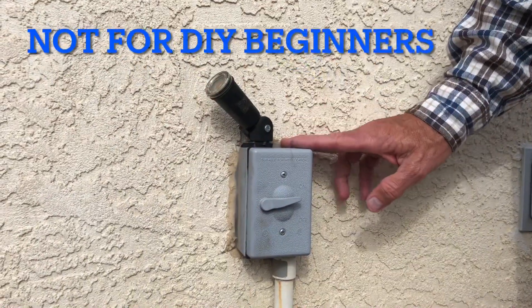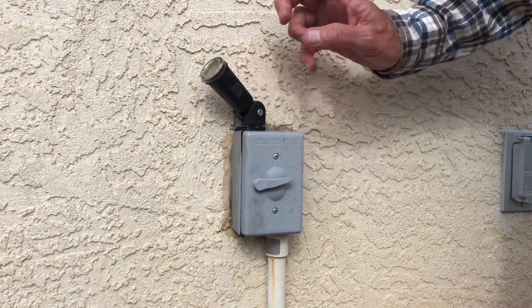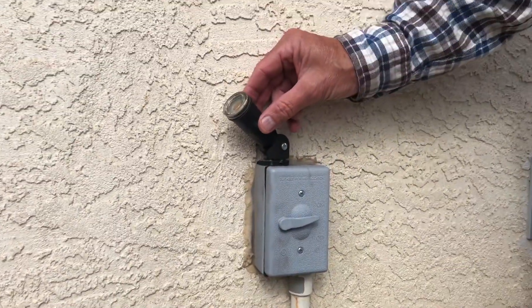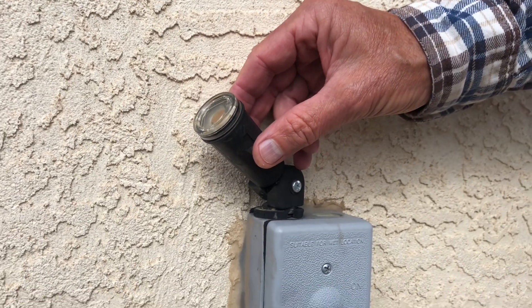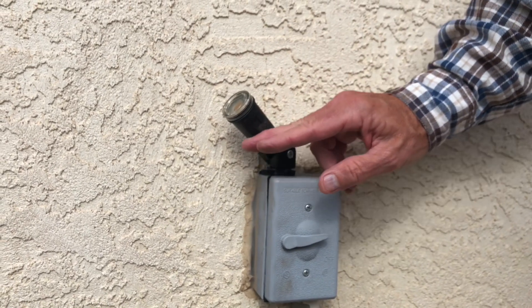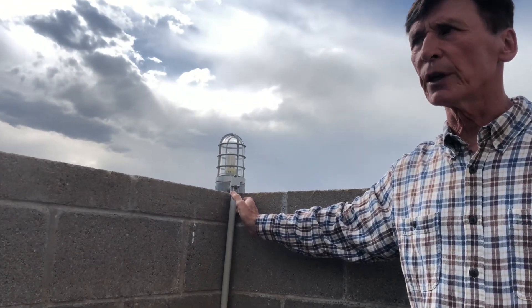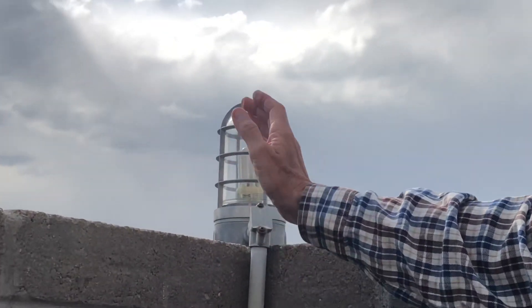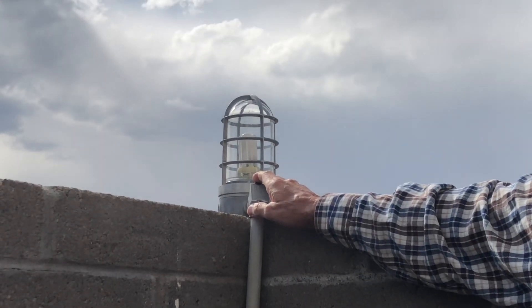This setup is quite a bit fancier — probably not basic DIY. It's a switch box with an electric eye that runs to a remote location. These electric eyes cost somewhere between $10 and $20. I've found them to be very reliable; they tend to last one to five years before they burn out. I've found it's best to wire them into the top of the box so that water doesn't get into them. This remote light fixture serves a dual function — it shines on the house and improves home security. Additionally, teens who used to gather on the other side of this wall at night have found another place to meet since the light was installed.